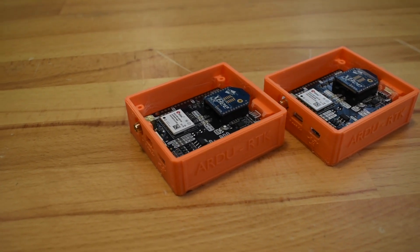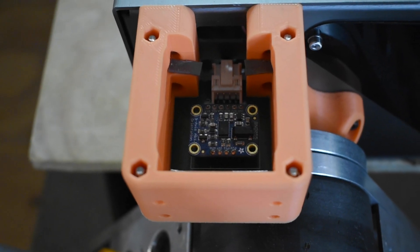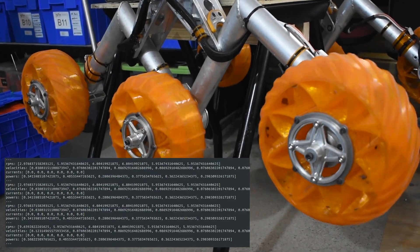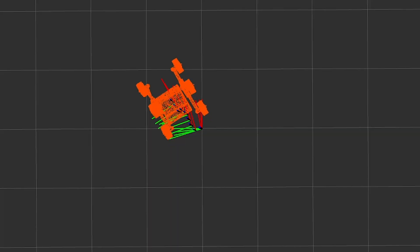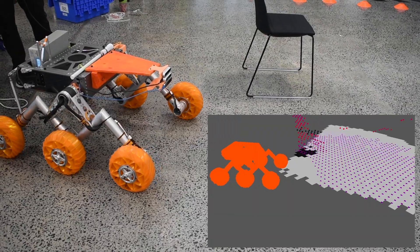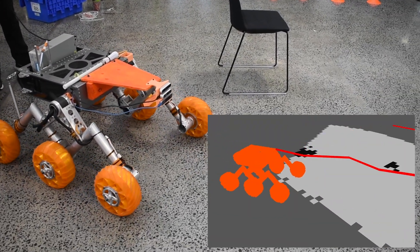The autonomous system has been designed for precise rover pose and robust dynamic obstacle avoidance. The new differential GPS system provides centimeter-accurate local positioning. Combined with orientation data from the 6-axis IMU, magnetometer, and precise wheel odometry, we obtain an accurate 6 degree of freedom pose through sensor fusion. A stereo camera generates point clouds, which are transformed into a global occupancy map where 3D path planning algorithms can continually plan safe routes.